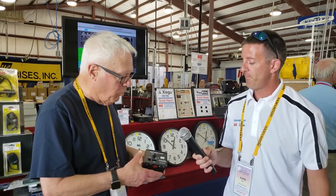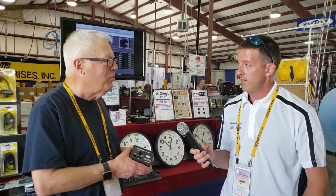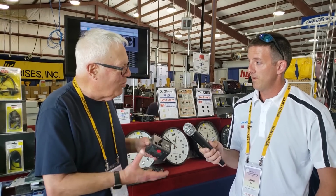Right with this. And what's beautiful is that everything you need is built in. VoIP is provided to give you two-way audio. The VoIP server is contained on the RigPi, on the Raspberry Pi board, so you don't need to connect to an external server, for example. You can connect any client to this on any Droid or iPhone or tablet or other computer. You can connect into the VoIP server on RigPi, and of course your station computer. If you're using a computer other than RigPi, you can connect that up.